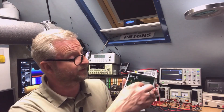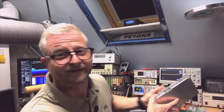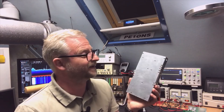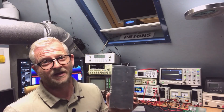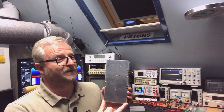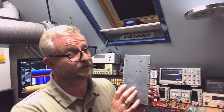Of course you have different qualities — you also have the bigger one from Trimble, which is also very good. These age a lot less. Or you can buy on the internet something more or less the size of a rubidium oscillator — that is kind of a little atomic clock. It works with a lamp and a photo cell and it's a lot more complicated. Those are really really stable, but you need 15 volts for the lamps and it takes 1.7 to 2 amps, so it does take a lot of power, plus 5 volts for the digital circuit.